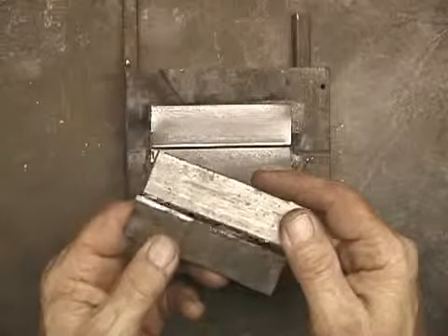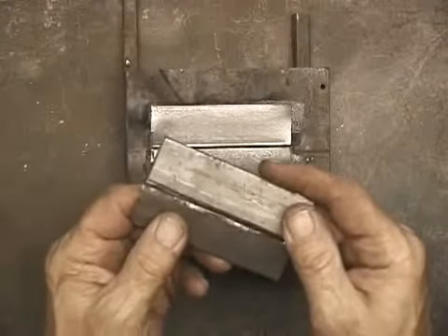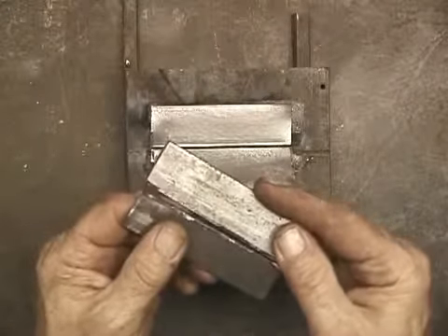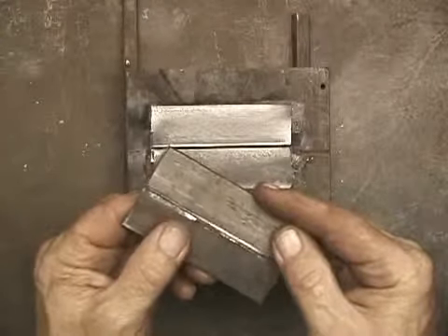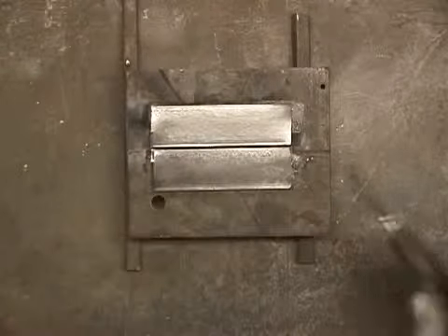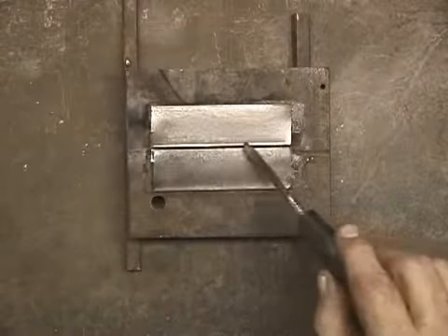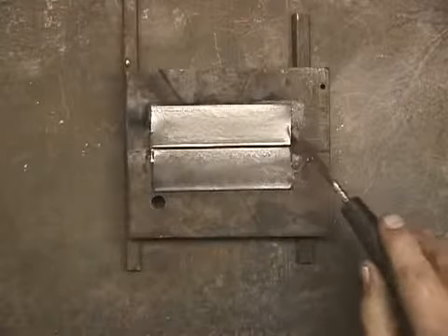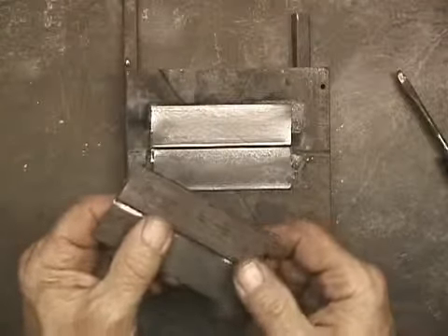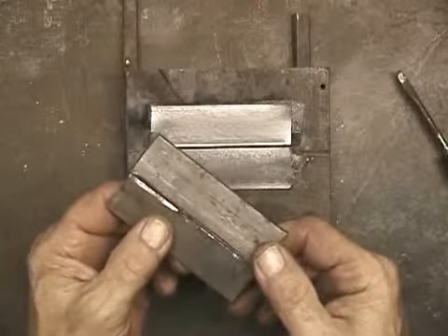Here are two pieces of 1 1/8 inch material, exactly the same as this. I'm going to braze these together, and if you'll notice, I've ground down the edges to take this down to base metal. In brazing, you want your metal to be as clean as possible. With this mill scale, if I tried to braze without cleaning it off, it just wouldn't accept the bronze — or it would put the bronze on there, but it would just flick off. So it's important with any material to make sure it's clean, but brazing particularly requires grinding down to base metal.